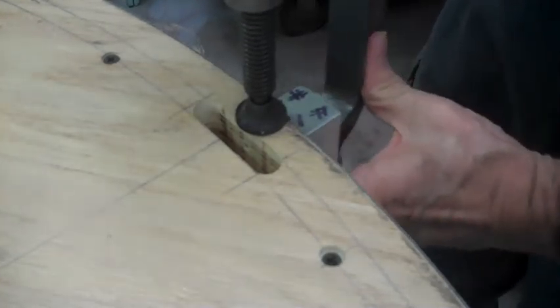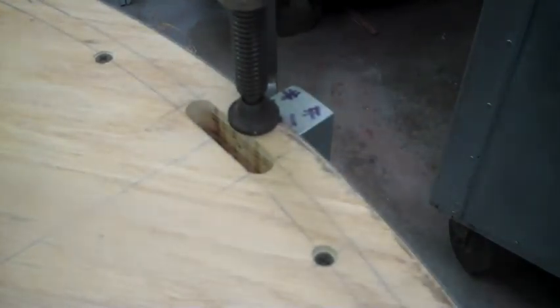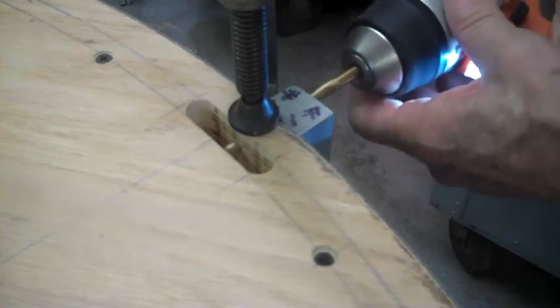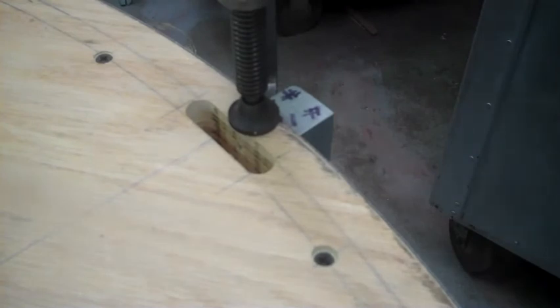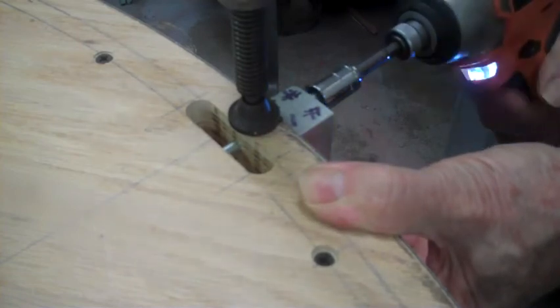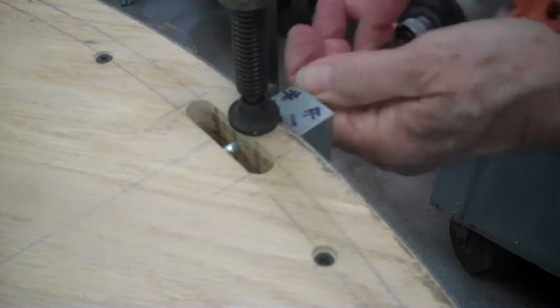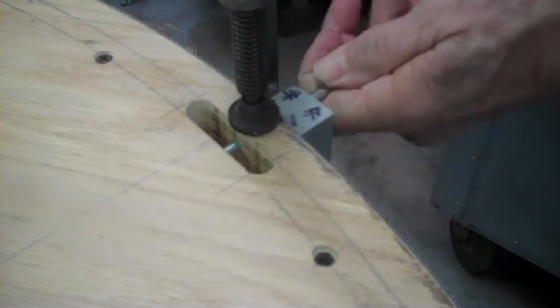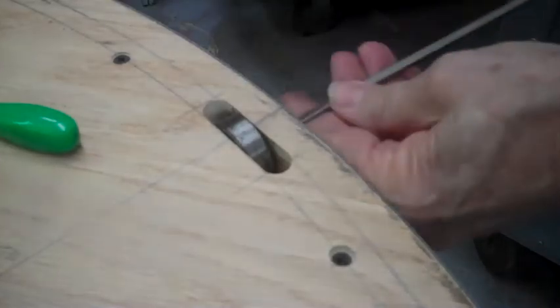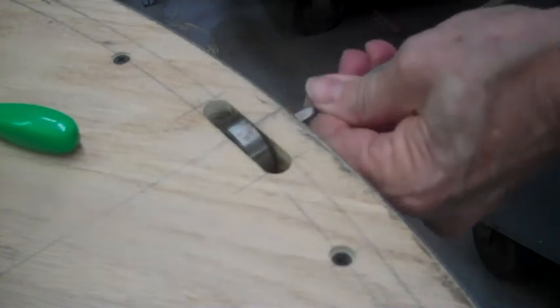So that's through the quarter inch side. Okay, we'll quickly drill the real quarter inch hole. This is where the main body of the bolt goes. I don't have a tap long enough to tap, so I'll just use a quarter 20 bolt, and hopefully get it back out. And here we are with the last 27 seconds of my record time putting in the axle. And there you go. Ball bearing for it to run on.